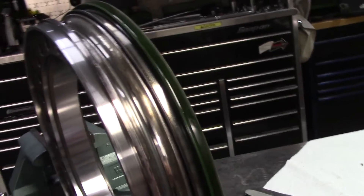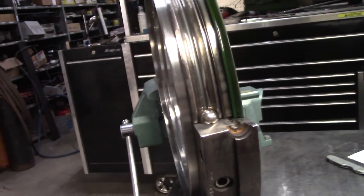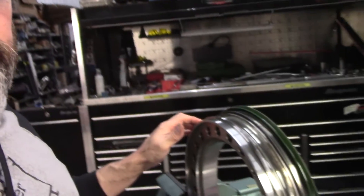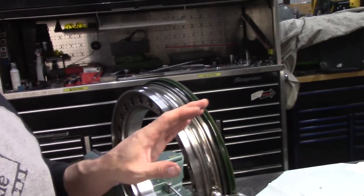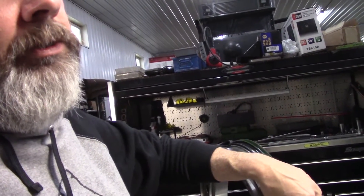You pump until you've got clean grease coming out. So what I learned — in essence — is you can't really grease the ball bearings. Like he said, it is a permanently lubricated bearing, just like what we have in the world today, just on a giant size. So in actuality, all this is is your weather seal — it keeps weather out. It's like a dual cone seal on a final drive, the steel-on-steel deal, to keep all the environment out of there.